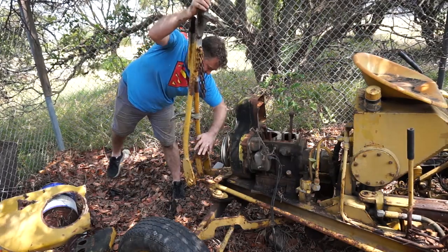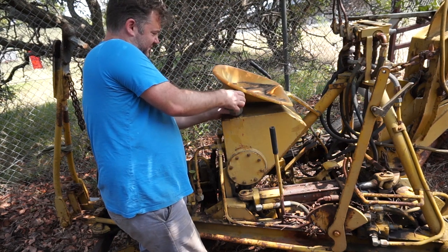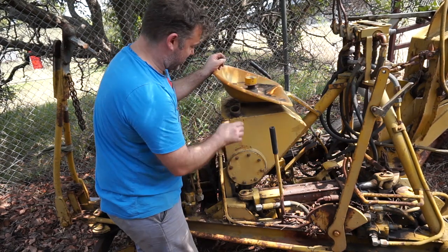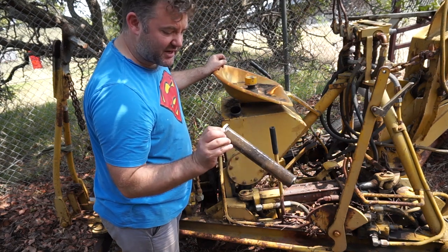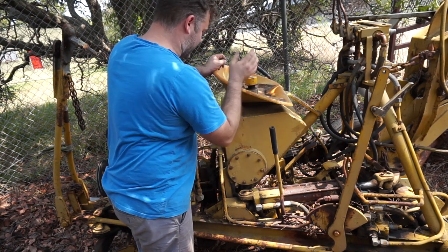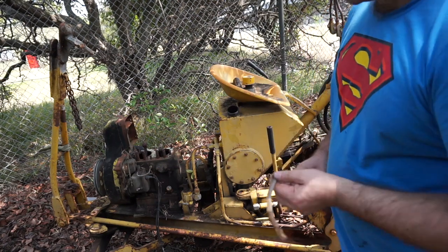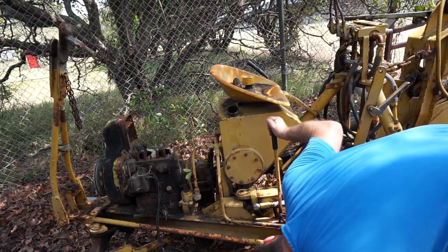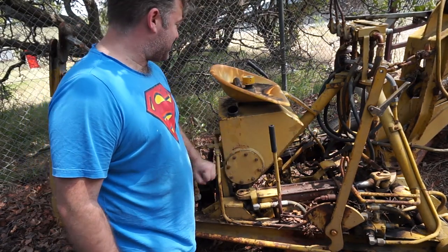It all needs about three tons of grease. There's a little brass filter to catch any bits coming out of the oil can as you pour it in. I've just dipped the tank with this stick and there's about two inches of oil in the bottom of it. Good thing about that — it means the tank didn't leak. There's no signs of a leak on it and no obvious oil pouring out of the bottom. Despite the fact it needs a bit of rust treatment, it's still a sound tank.